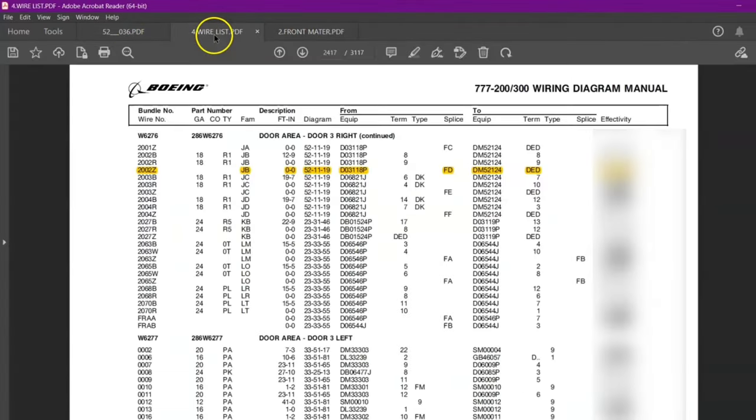Okay, so here there are many options. Previously we went in dead end shield. Right now, we already have a wire in our shielding. This is a separate wire, which is connected to the shield. So, as per our condition, we will go in assembly of shield ground wire without integral wire, because we already have a separate wire. If we don't have a wire, in another case, we will be going in with integral wire, insulated integral or not insulated integral. And these are the special case of sleeves. Right now, we'll not go in that. So we'll go in solder sleeve without integral wire because we already have a separate wire.